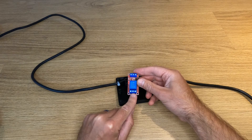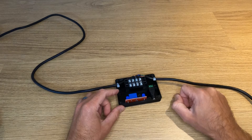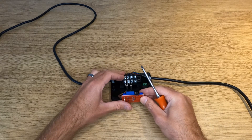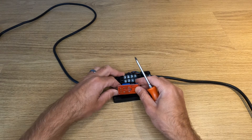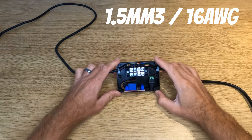The relays I've used are rated at 10 amps and 250 volts AC, meaning that using them for the 240 volt mains here in the UK with a 3D printer with a 500 watt power supply is no problem. Connect the common and normally open terminals on the relay to the two live wire terminals on the screw terminal block. Make sure the wire you use here is capable of carrying the current the relay is rated to — I've used 1.5 millimetre squared, which is about 16 gauge, matching the power lead wire rated to about 15 amps.